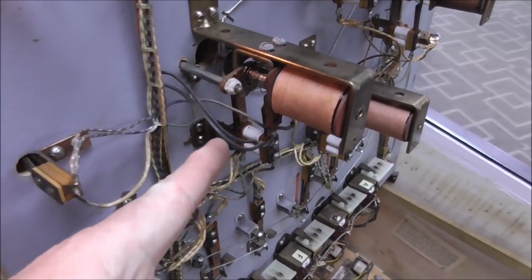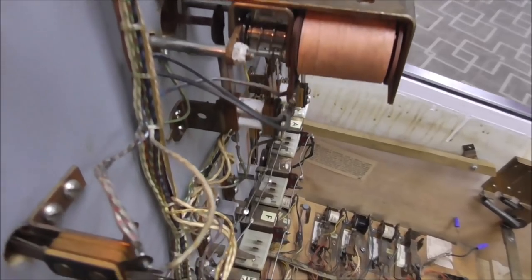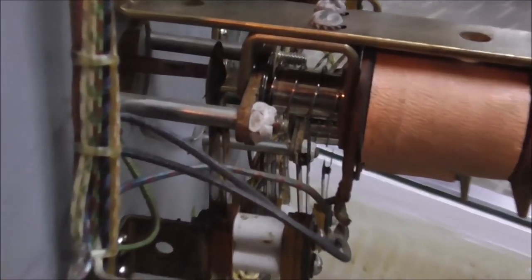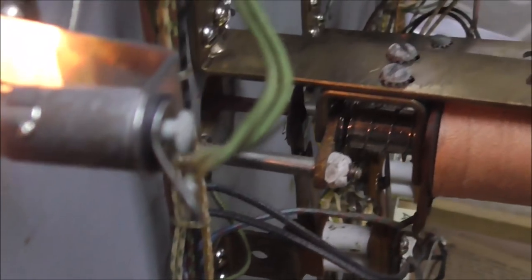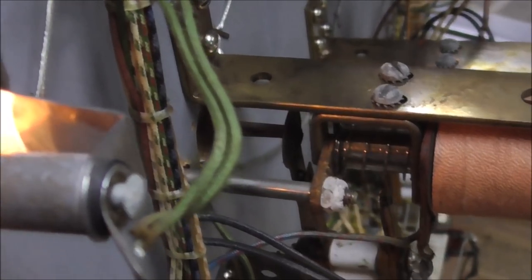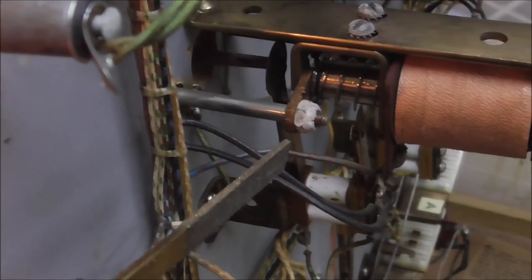So here's one of the working pop bumpers. This is the purple one. And as you can see, there is a little spoon-looking thing. This is going to be hard to show you because it's buried down in there. But there's a little spoon thing, and whenever I hit the skirt, this is going to pop, by the way, so get ready. So what's going on is the spoon, that switch is connecting, which is turning on the relay for it.